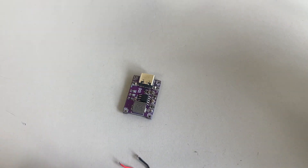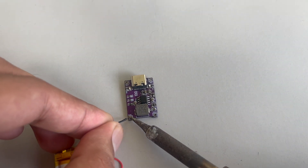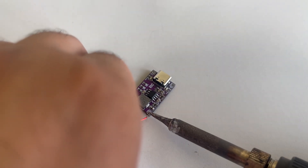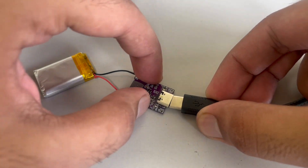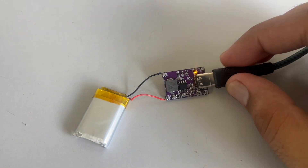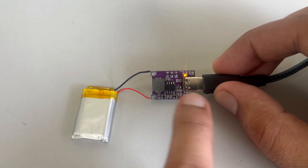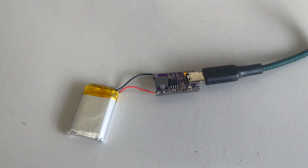In order to do this we just have to solder the ground pin to ground, and then the VBAT or the plus pin to the VBAT. Now we just take a type C cable and plug it in. You can see the LED starts to glow — that means the battery is being charged. Once the battery is fully charged, the LED here will glow and the charge circuit will cut down the charging. Let's wait for the battery to charge and come back after a few minutes.